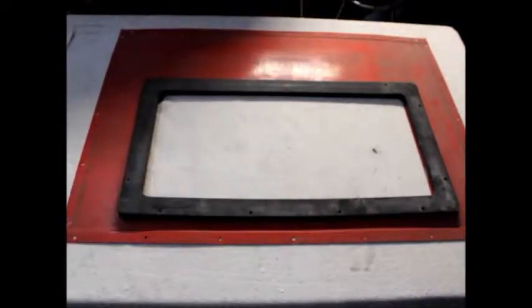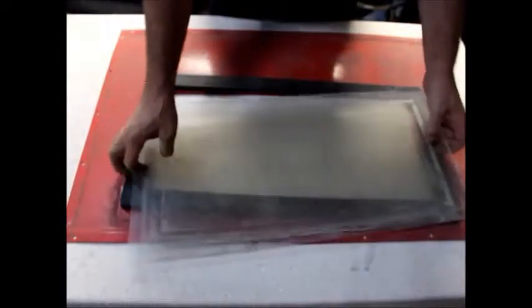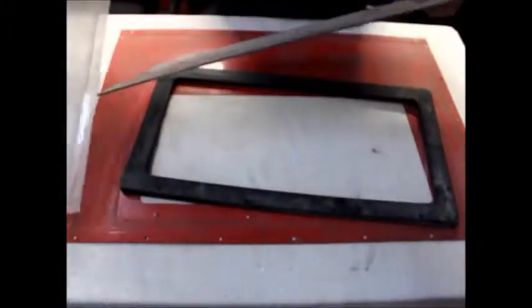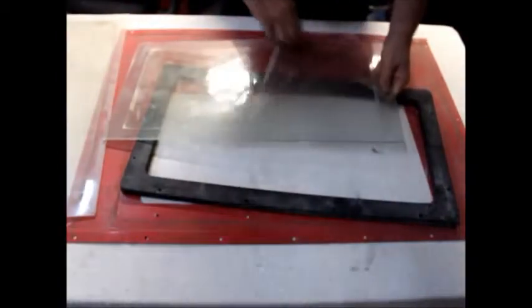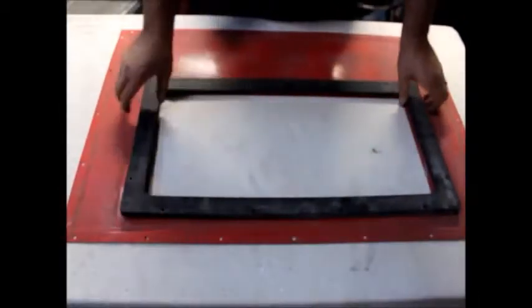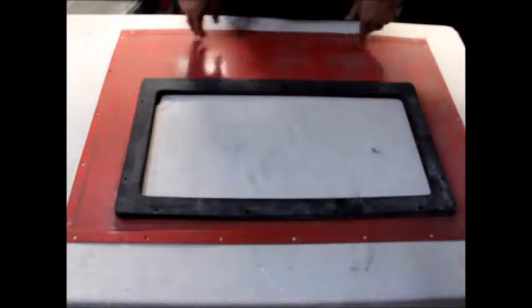So the next part of this upgrade — this is how it's usually set up. You have this piece of plastic and you have the glass in the normal setup. What we're going to do is remove both of these, get rid of this etched plastic and etched glass with this ridiculous piece of removable plastic that just gets thrashed as soon as you start using your machine. We're going to get a piece of single strength glass to use as sacrificial glass and a piece of double strength glass, or you can just get a new one, which is what I'm doing.